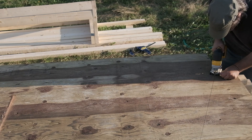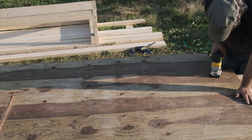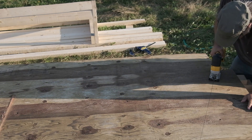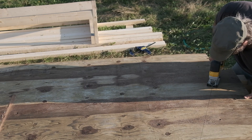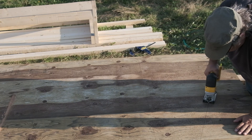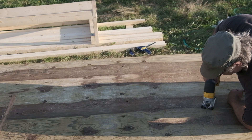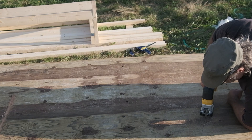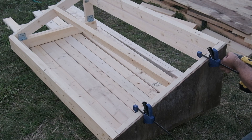At this point, both roof frames are completed, and now I'm shaping and cutting out the sheathing — in this case, a gable for one of the roof sides. When the gables are done, I'll cut out a single sheet to form the roof itself. I've looked at a lot of potential roof covers, everything from steel roofing left over from a job I did on my house earlier in the summer, to various kinds of EPDM and other quick glue-on roofs. In the end, I decided to go with liquid rubber — it's durable and it'll make the lightest rooftop possible.